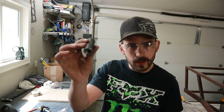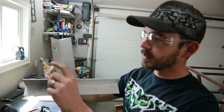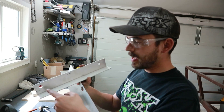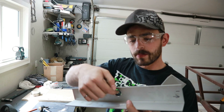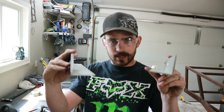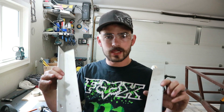I was trying to figure out how to properly hold our threaded plugs at the right height and perfectly parallel, and this is what I came up with. I took two pieces of two-inch aluminum angle iron. In this one I drilled two half-inch holes exactly 0.7 of an inch down off the top on center, and exactly 11.5 inches apart - that's how far we want our lower heim joints. On the other piece I did the same thing, went down that 0.7 of an inch, but drilled a way bigger hole to hold our big ball joint. Now all we've got to do is take these two pieces and screw them down to a chunk of MDF, parallel, exactly 10 inches apart, then screw all the threaded plugs in there, cope our tubing, and tack everything up while it's in this jig.